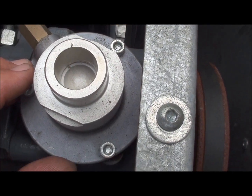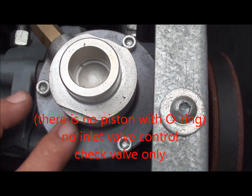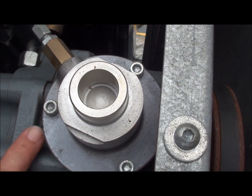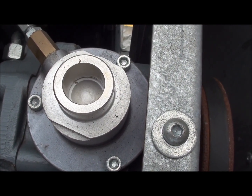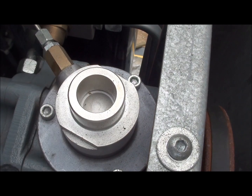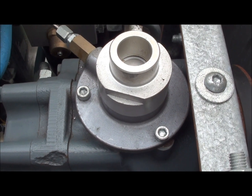This is known as an open inlet, and it acts as a check valve — a one-way valve. There's a piston in here with an O-ring on it, and it just takes a pilot signal to close it — that's to stop it from pumping. Most of these Atlas Copcos have a closed inlet that requires pressure to open. This one's a little different. The oil is probably not going to drop past this spring-loaded check valve, so I'll have to put a little screwdriver in here, carefully pour some oil in, and rotate it in the direction it turns — that should all end up in the sump tank.